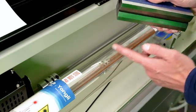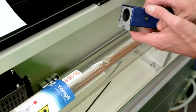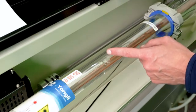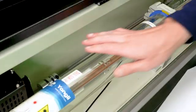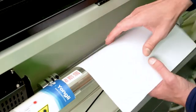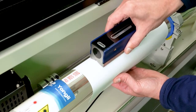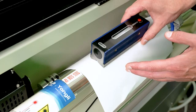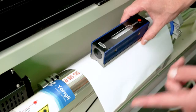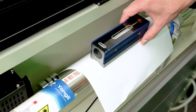When I check the level of the laser tube, I want to make sure that I protect it from the bottom sharp edges of the fine ground metal — I don't want to chip or crack my laser tube. So I take a sheet of paper and go to a spot where there are no stickers on the laser tube, place that paper on top as a nice little cushion, and very gently set the level on top. I just want to have an idea of whether there's an end of the laser tube that is high or low.